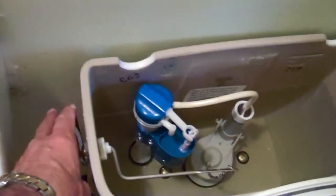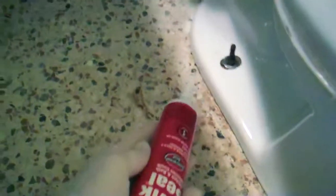I've turned on the water — filling her up — and we're going to give it our trial run. Let's see if we've got any leaks. I put my hand under here, I don't feel any water. Nothing here either — so far, so good. This is filling up; it doesn't have a ball float, it's a newer style. Ready? We have toilet! The last thing we've got to do is grout the very bottom of this, which I'm going to do now. I'll wipe the excess off after. We have a new toilet — looks pretty good. Hopefully there won't be any problems.